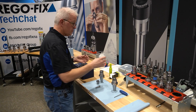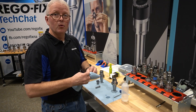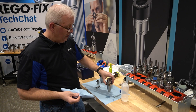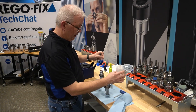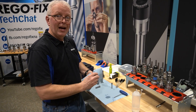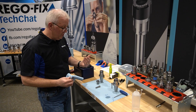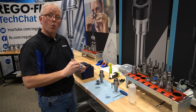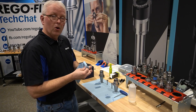The cleaning process is pretty simple. We like to use alcohol for cleaning our test tools — a little alcohol on the tool shank and simply wipe it off to get rid of any hand greases or oils left behind from storage, and this tool is now ready for use. As far as the holder itself goes, they were all cleaned about the same way. I like to use nylon brushes and alcohol — pour a little in the ID and give it a good clean to make sure that we get all the oils and preservatives out of the ID. As far as the ER product goes, we do the same thing for the pin. We will clean the pin and we will clean the collet itself to get rid of any oils or preservatives, making sure they're nice and clean before we go through to our setup and assembly.